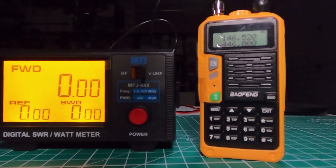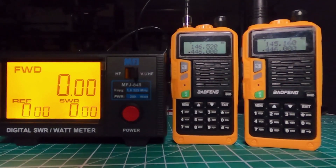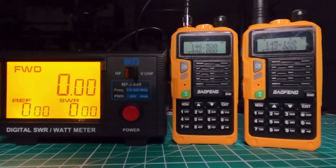Well, neither one of these radios delivered the 8 watts as shown in the advertisement on Amazon — seems to be a running trend with some of these Baofengs. Will I keep them or return them? I'll probably keep one of them because one got to 6 watts, and the difference between 6 and 8 watts is not a whole lot. I do think they're a great radio to keep in the glove box, and also great if you have a youngster just starting out or want to gift it to a new ham. Thanks for watching — if you have any comments, questions, or concerns, please leave them in the comments below. Please subscribe and click the bell so you'll be notified each time I upload a video. There is a Patreon link in the description if you'd like to support the channel. Thanks for watching!